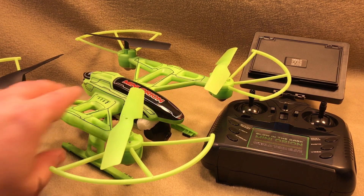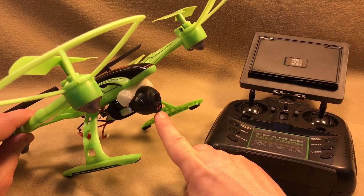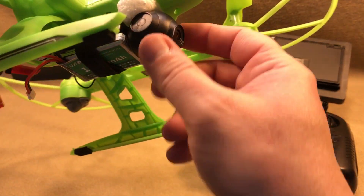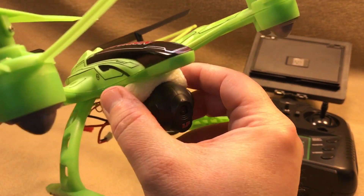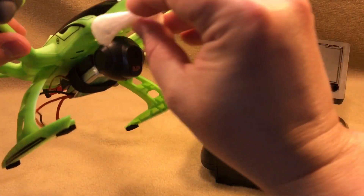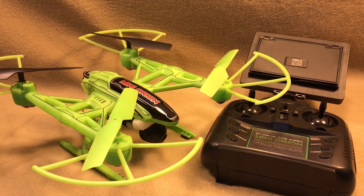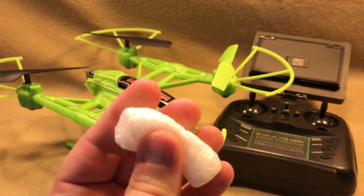Next, I want to talk about the camera. These cameras are okay but not very stable — you get a lot of wavery, shakiness in the video just from the flex of the drone, plus I think there may be some electrical interference since there's no shielding on the speed controller. You can take care of a lot of the jitter by putting basically a packing peanut between the fuselage and the camera head. I just took a packing peanut, compressed it down, and slid it in there. It actually works pretty well. It won't turn shaky video into perfectly smooth video, but it can make signs and things a lot more readable. It's still a little jittery, but not as bad — and it's a really cheap improvement since packing peanuts are usually free. The corn-based ones that compress really well are best.